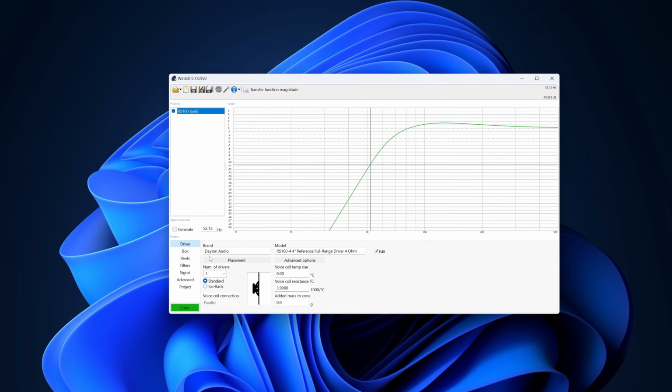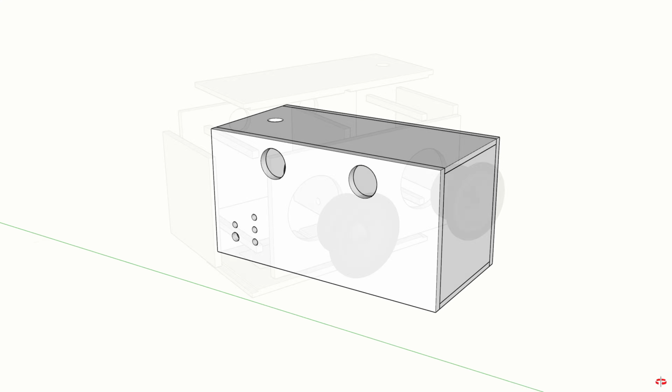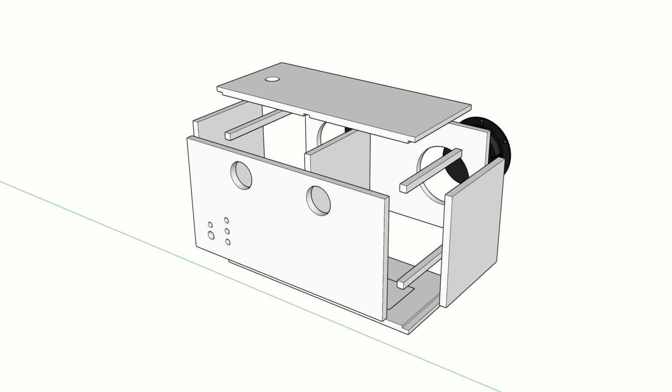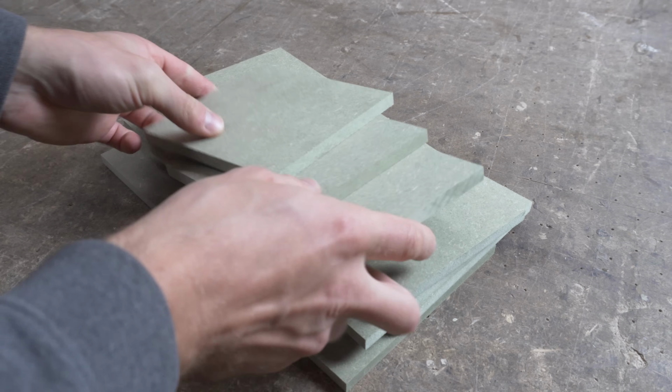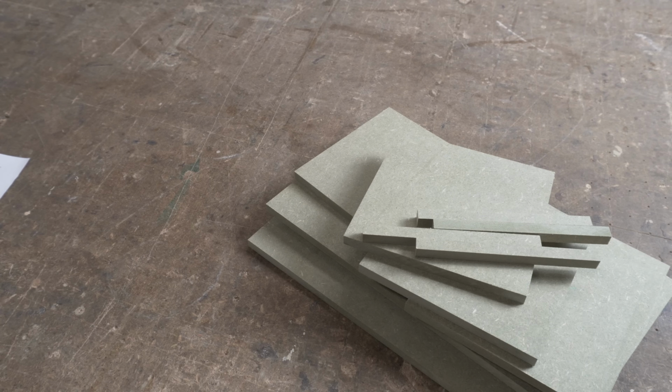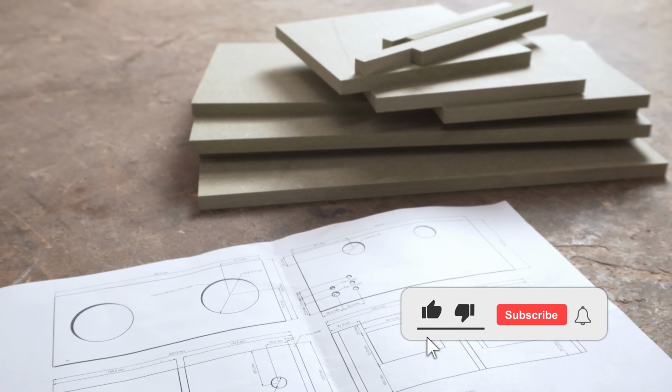I'm starting off by calculating the required volume for each speaker on WinISD and creating a design for the enclosure. For this build, I'm using 10mm thick MDF board, which I cut into pieces for the enclosure according to the plans which you can find in the description of this video.